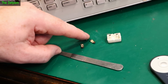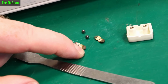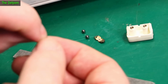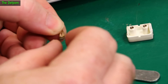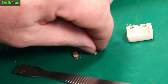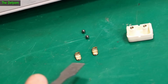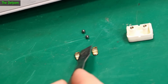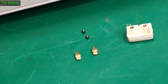And this is on the side you can see. And you can see the little line where the ball bearing's been running on that contact. Right. So it's been pushing that side. So the contact is in a switch in this orientation. Right. Although it's not in focus right now. You flip them over. And the contact is made between these little domes and the hinge point of those switches. So the hinge point is one half of the contact, the dome part is the other part, and also you've got the mating part inside the switch as well.